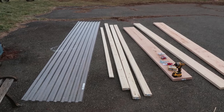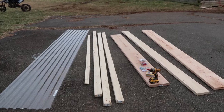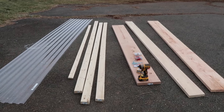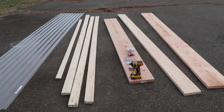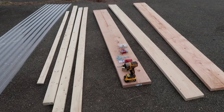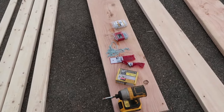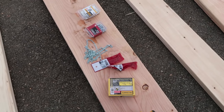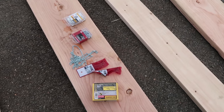Here's a quick overview of the materials you'll need. You'll need transparent plastic for the lid, one 1x3, a few 2x4s, two 2x12s, and one 2x8, deck screws, miscellaneous hardware covered in the steps, a drill, a skill saw, a t-square, a measuring tape, a pencil, and wire snips.